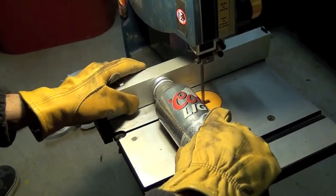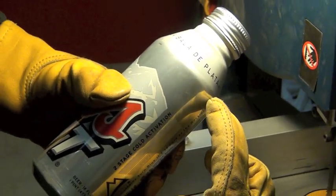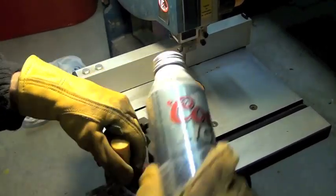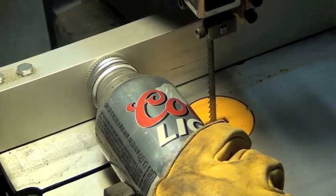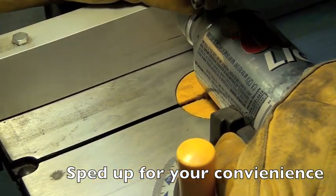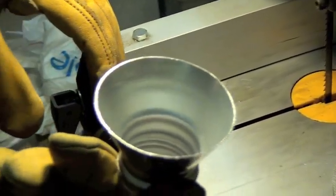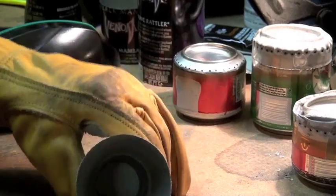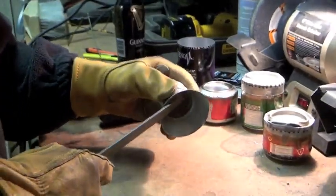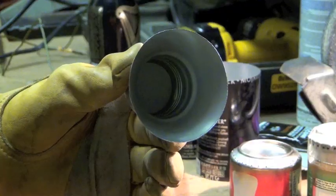When we cut this with the band saw, we're going to cut just after the round — see how it's tapered here? We're going to cut right down in here. Lock it down, stick the miter in, put it up against the fence, turn it on, and there we go. Now I've got a half-round file — flat on one side, curved on the other — and I'm going to come inside here and just take off all the burrs on the inside all the way around.